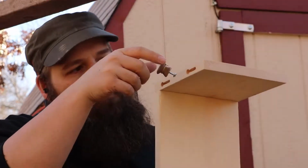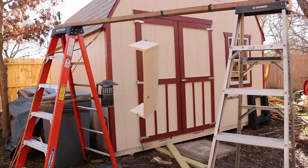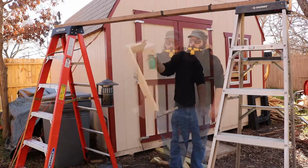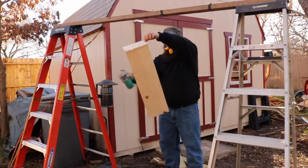To suspend the shelves for spraying on finish, I tied some string onto a loose drawer pull and made use of the keyhole slots. I used a matte clear lacquer finish, spraying on a few coats, lightly sanding with 220 grit sandpaper between coats.